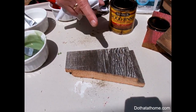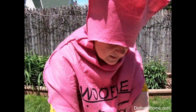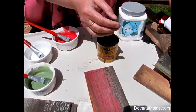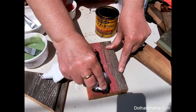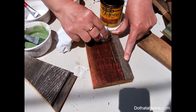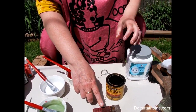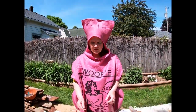The stain sticks to the mountains but not the valleys — not going into the low grain — so you have a really nice look at that point. You can do this as much as you want. Then if we go to our barn look — which is a little pink — the stain should knock this right down, giving more of a red barn look. When this is all done and your stain has thoroughly dried, simply take some polyurethane and apply a coat or two to the top, depending on how much time you want to put into it, and you're basically done. You can do this on picture frames and all sorts of other projects.